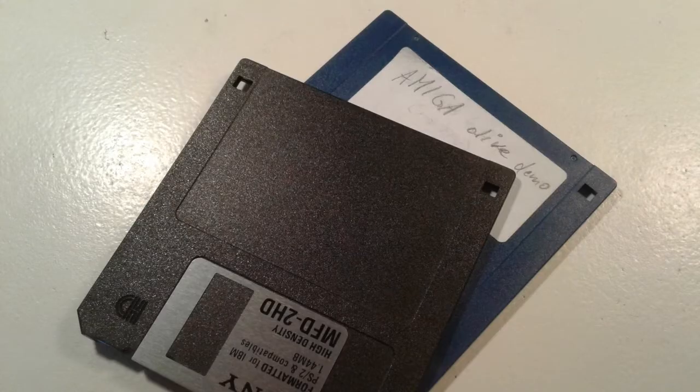Let's take a look at these two floppy disks. The blue one is a double density, or DD, disk — standard for most Amiga floppy drives. It has one rectangular hole near the left side of the drive slot. This is the write protection hole present on all 3.5-inch floppy disks. On the back side of this hole there's a small movable plastic part that allows covering it — it's the disk's write protection switch. The black floppy disk is a high density, or HD, one. It has an additional rectangular hole near the right side of the drive slot. This hole will release a second switch present only in HD floppy drives, telling the drive that an HD floppy disk medium is present.